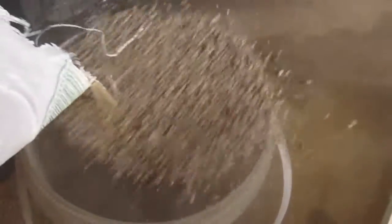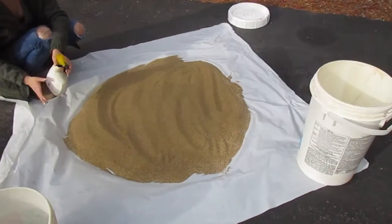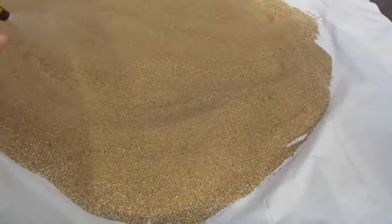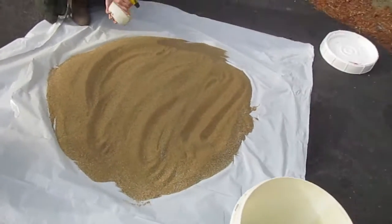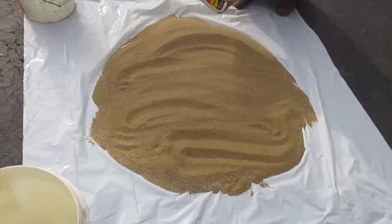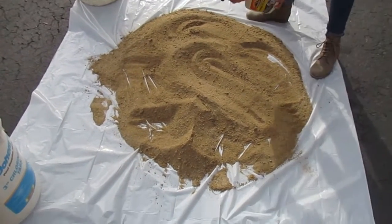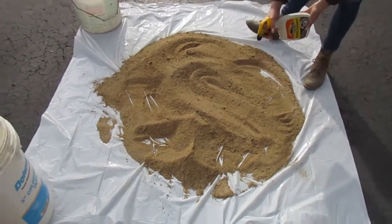For the green sand we wanted to make, green sand is a combination of a binder and sand. In this case we used bentonite clay, which is basically kitty litter — you grind it into a powder, mix it with the sand, and slowly add water so it clumps together. We spent the better part of half a day figuring this out. The sand didn't clump as well as we wanted, so we ended up adding a lot more clay than recommended. It was a 10-to-1 ratio recommended, but we added something like three or four to one.